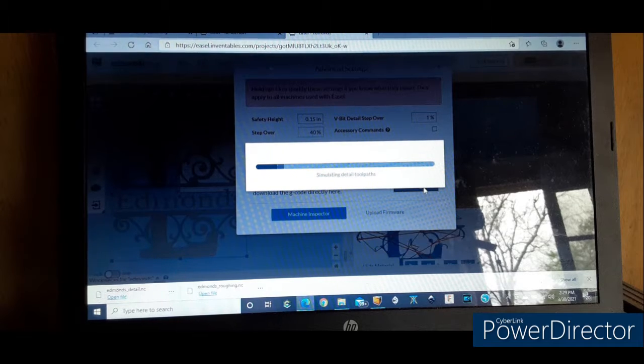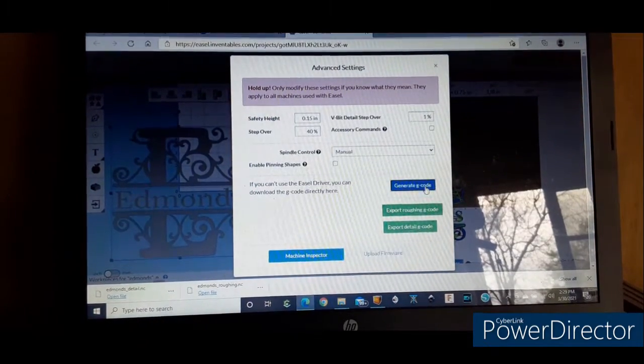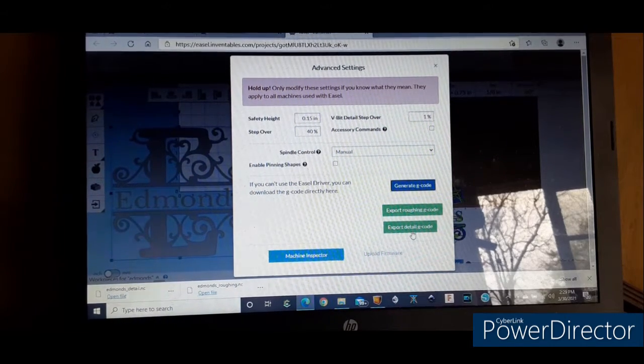Now if you don't have Easel Pro, it'll tell you you need a subscription, or if you were subscribed before July 2020, you'll get four free days. So you'll have to use one of your free days. And then it'll come up and say Export Roughing G-code. That'll be the first one you use, and then Export Detail G-code, and you'll save those.